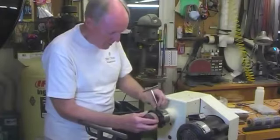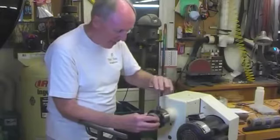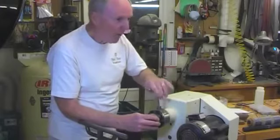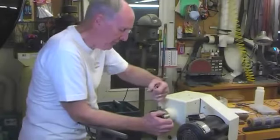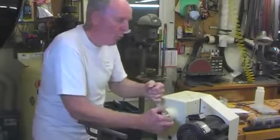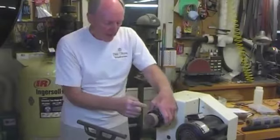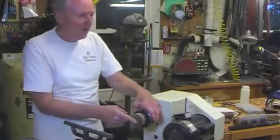One thing for making thin saw kerfs in dry wood is either the standard back saw or the Japanese saw, which is real thin. You can start where you're going to separate something, say with a skew, and then stop it, and then just start sawing and turning it towards you slowly. And it's amazing how well you can do.